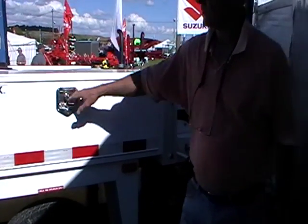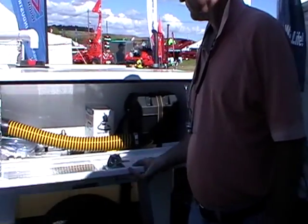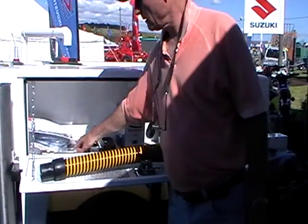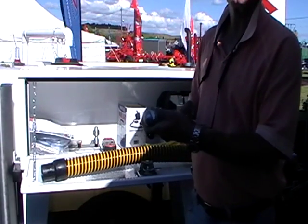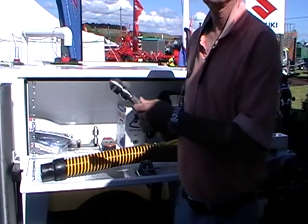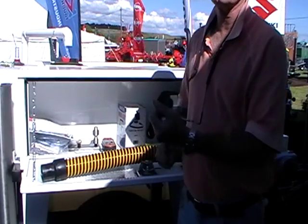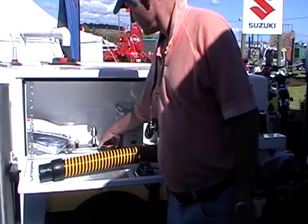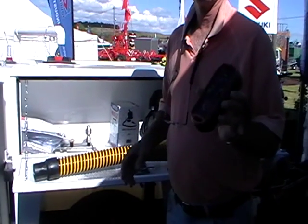Aluminium toolbox, aluminium mudguards, aluminium fuel and hydraulic tanks — so you haven't got a rust problem. Tiger tail hose protector, nozzle rack, nozzle and drainjet extension. It's important to use the extension so the hose doesn't come back out of the pipe, so you should use an extension whatever the diameter of the pipe.